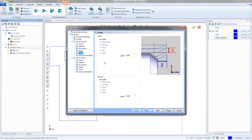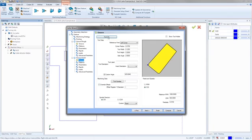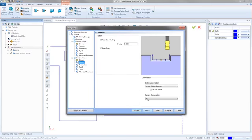They got all the options, but with a groove, you can only start with a parallel lead in or lead out, because the groove rough is just going in and making straight lines. When we get into the groove finish, we'll see a few more. So here's the groove finish. I'm going to go back up to the tool crib, pick that same tool number 2, and then just next my way through.